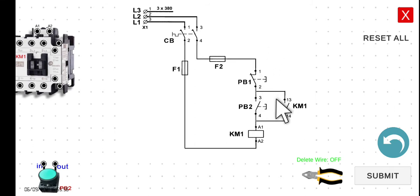So how does it work? Take note: if you press PB2 and close it, with your finger still on the push button, the current will now be able to activate or energize KM1. At the same time, if KM1 is energized, this KM1 normally open contact will now be switched on — there will be a closed circuit here. So since your finger is still on the normally open push button, the current now has two options: it can flow through this path here and also through this path here, since this contact is already switched on because KM1 is energized. The current will flow here and the current will flow here.